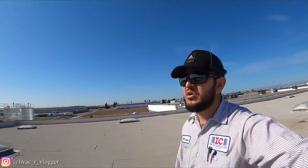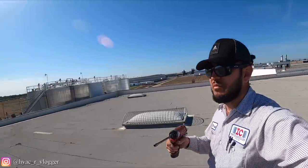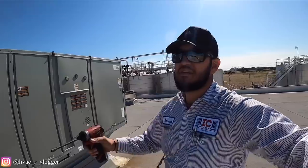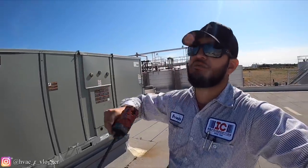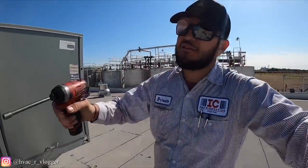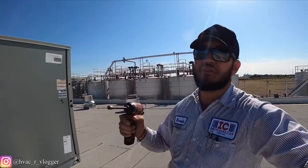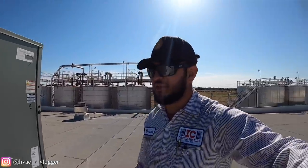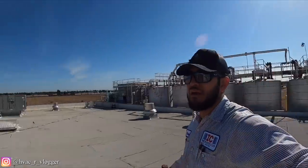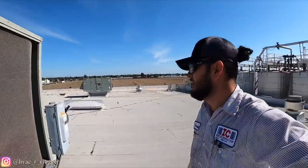So what I like to do anytime I do big maintenances, what works best for me is to go around and check all of them, give them a quick check. So basically check, you know, coils, filters, belts, things like that. And then after that, wash the condensers. And after I wash the condensers on all of them, then go through every single one of them and check pressures, temperature splits, things like that. I find out that it works better for me like that. But on all of them, they don't look that bad. But I'm still gonna go ahead and wash them down.